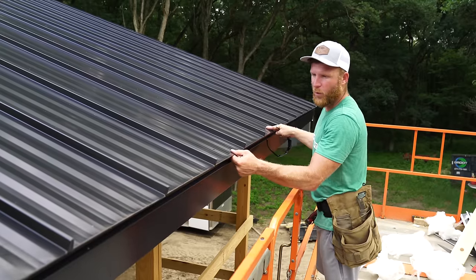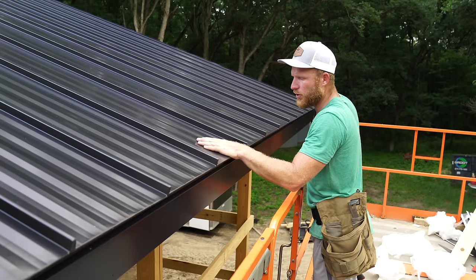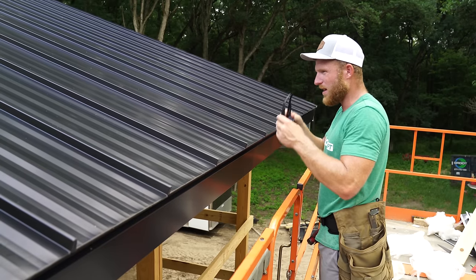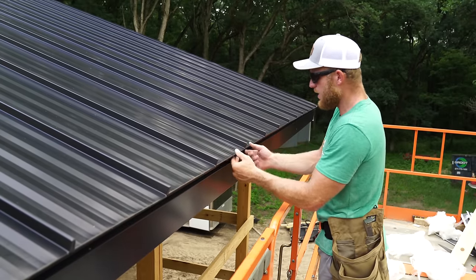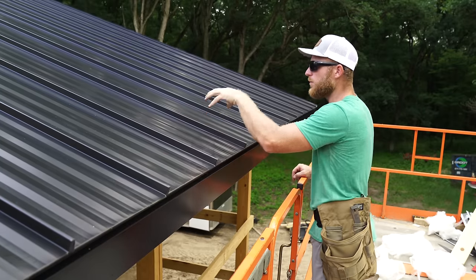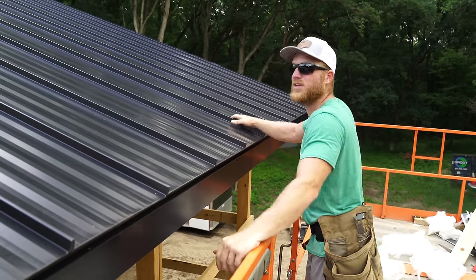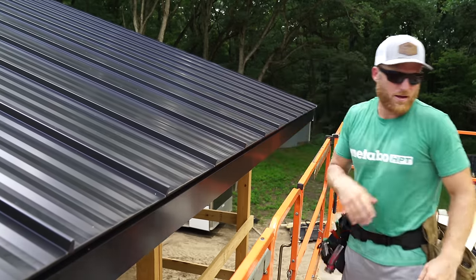As you can see, the way that this works - no fasteners, just locked on. I can't stress enough that this is how you obtain a watertight, lifetime roof. This first little section is on and look at how nice that looks. This hem is all closed now with the hand seamer and it's nice and tight - not going to allow any wind-driven rain, ice dams, nothing is getting through this. There's no roof penetrations, it's locked down with the snap lock roofing. It's a gorgeous looking roof. I love standing seam and I know the client's going to love it.